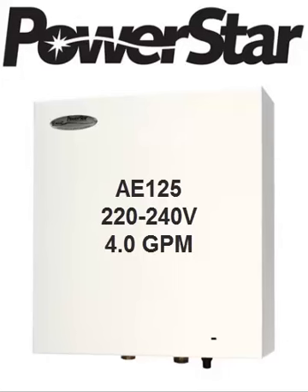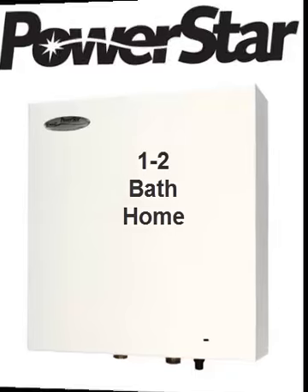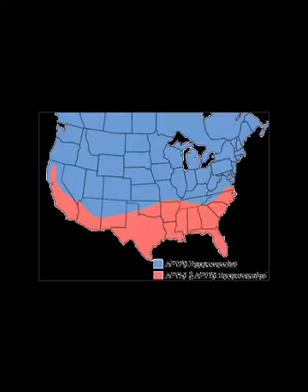This particular unit is small and compact and would typically replace a 40-gallon standard tank type water heater. Tankless water heaters are unique in that incoming water temperatures play a large role in how your unit will perform. Colder regions don't do as well as warmer regions — keep that in mind.